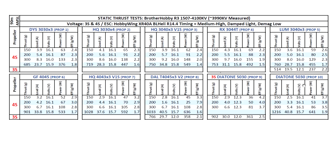I threw in a 5 inch 2-blade prop just to see what the motor is truly capable of, and here we can see that's pretty insane - 1.2 kilograms out of this motor. That's almost what we were getting back in the day with the 2205 on 3-blade props, right about 1.2 to 1.3 kilograms. Not that you can use that prop, because it's going to require a large battery and that defeats the purpose of having an ultra lightweight. This motor is mainly for 3 inch props on 4S. Very powerful little motor from Brother Hobby.